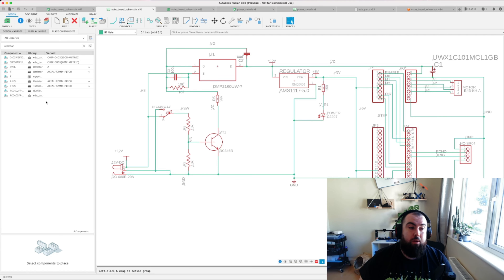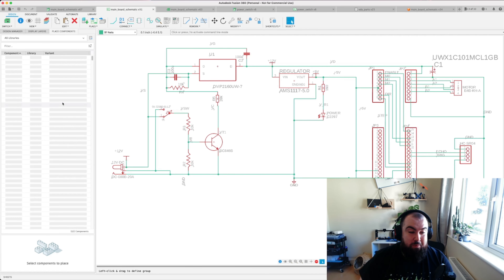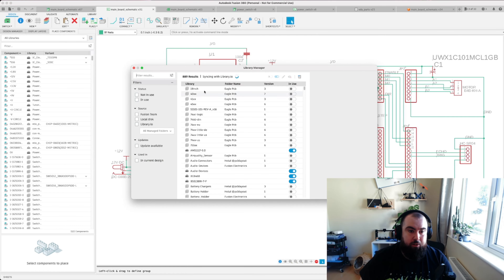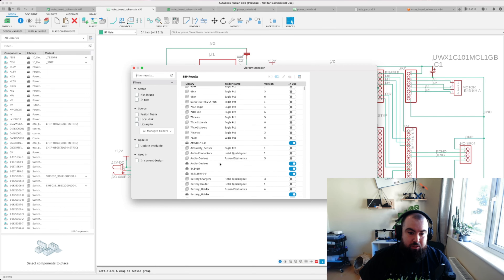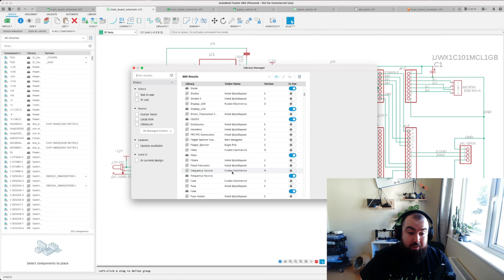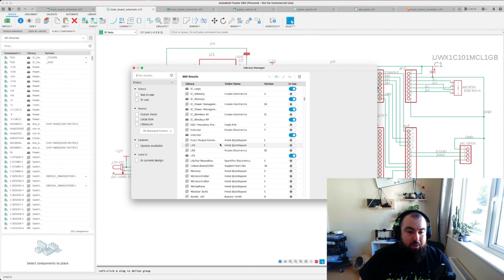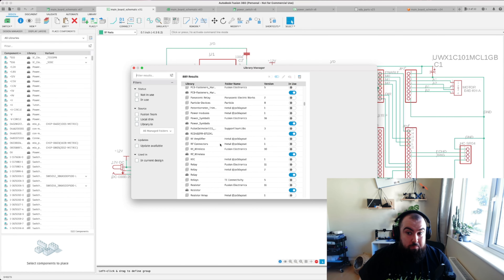You can use some of the built-in libraries and some of them will just work straight away. But you're probably better off making your own library. Within Fusion 360, you can build your own library from scratch. There's a library manager with Eagle PCB built-in ones and loads of others you can download and import. But part of doing that is just trusting that the person built it correctly — it might not be right at all. The pins might be laid out wrong or the pads might be the wrong size and shape. You have to put a lot of trust in the people who made them.